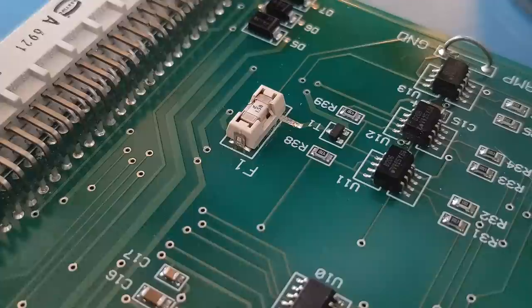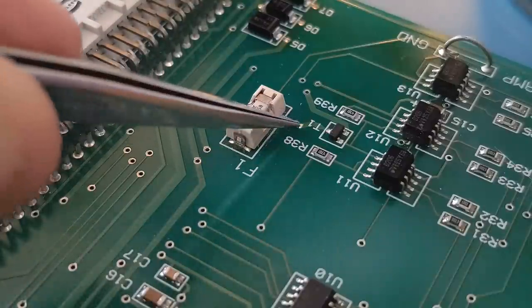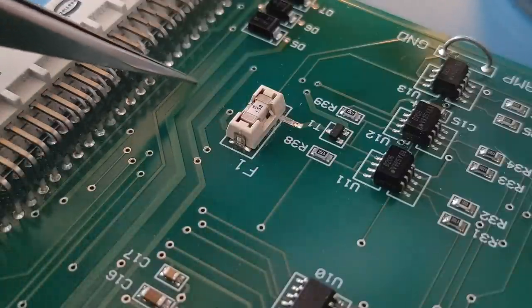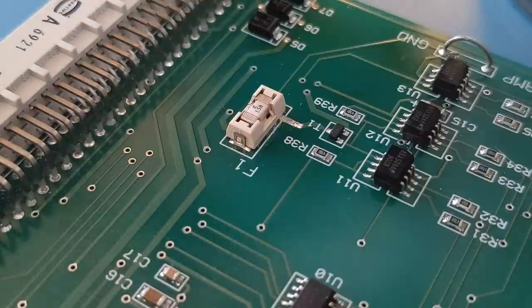I know a lot of people will probably say, why don't you just solder it from that pad straight to there, because you probably could with this, probably swing it around. But if you've got a really long trace, for instance this one was all ripped, this method's really good. It's also good if you've got quite a large area where, say, contamination's taking place. You can just cut that part out and completely match the area with the copper tape. So it's a great method. Hopefully you've enjoyed it, and hopefully you've learned something.